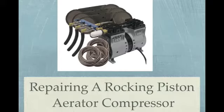There are cases where we'll see a rubber seal leak a little bit through time and through operation, and these compressors are meant to be run continuously. They work best that way, but over a period of years, eventually the rubber seals will wear down. Once this seal is degraded, then the air compression will drop. In other words, you won't see as much air output out of the diffusers or as much bubbling, and when you see this, you know that it's time to change the seals out.